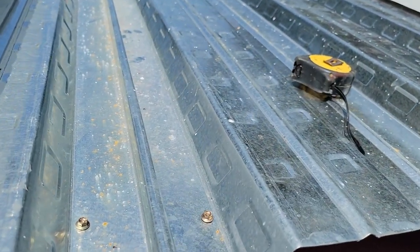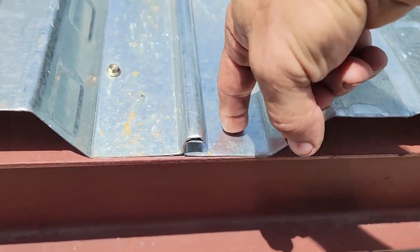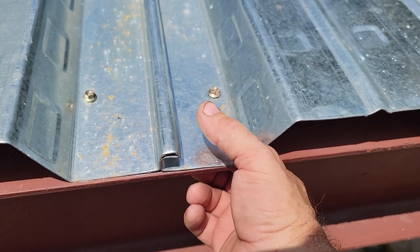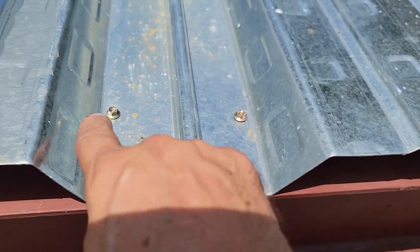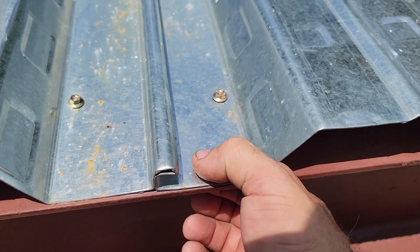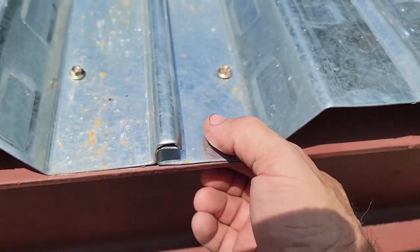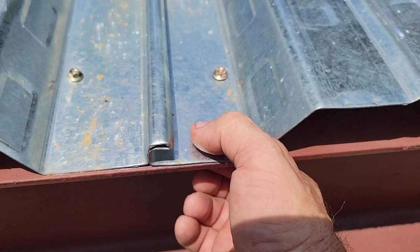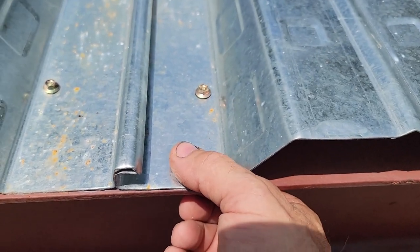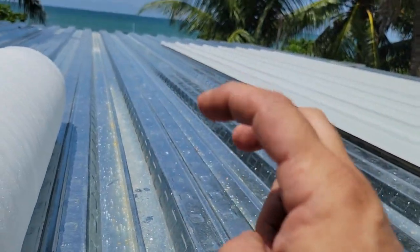And probably for a little bit of earthquake proofing before we pour concrete, I'm probably going to drill holes through this. And I know it sounds crazy, but I'm going to put bolts with washers and nuts. The reason being, if there was an earthquake, these can just shear right off. And then this thing's just floating up here on top. But if I can put a bolt and not make it fit super tight, leave some room around it, and washers, it can work around then, and it would take more strength to shear it, and it would make it a little bit more earthquake proof. Like say, oversize your hole when you put the bolt in there and put a flat washer top and bottom. So that's what I'm going to do. It's a little bit of work, but that's all for that what if.